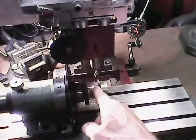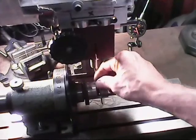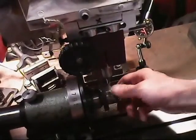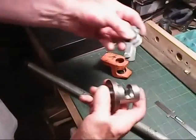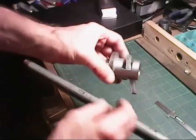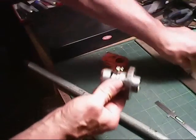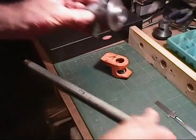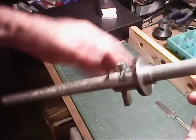Okay, what I gotta do now is I gotta machine this back farther so we can get this to lean back to make the clamping. But that's going to fit in there nicely now. Okay, let's try and see how this works now. You drop down the side like that. And of course this is going to go this direction here now, because this is going to be the flange that's going to go on the back side of the workbench board like this, and then the jaw side here, the movable jaw, will be on this side here. So I slot it on here, and there we go.